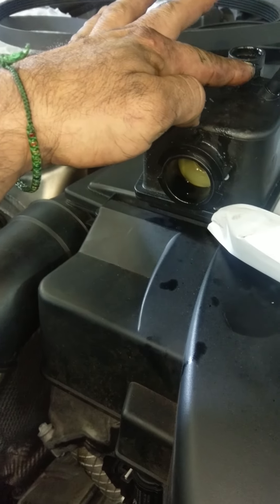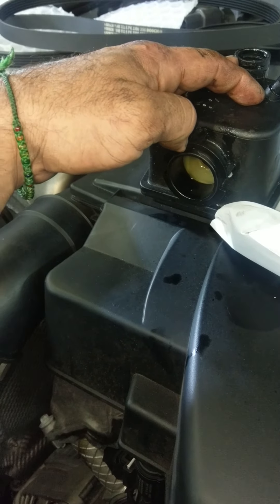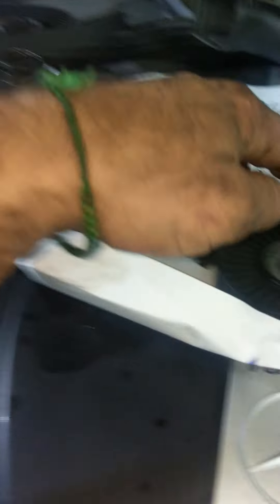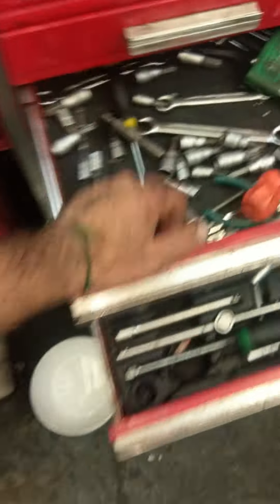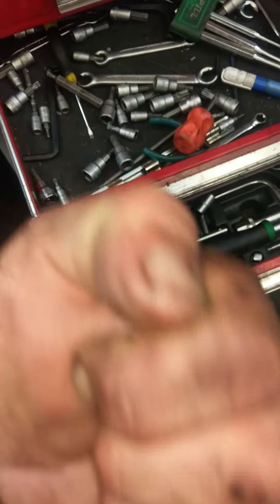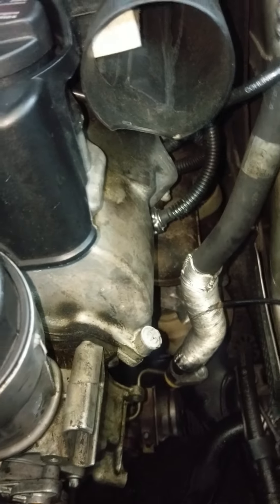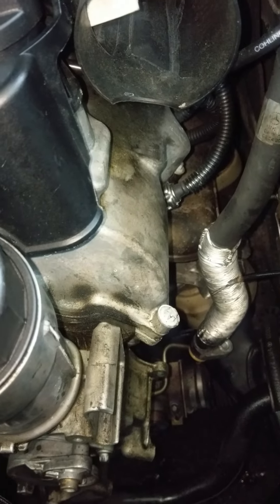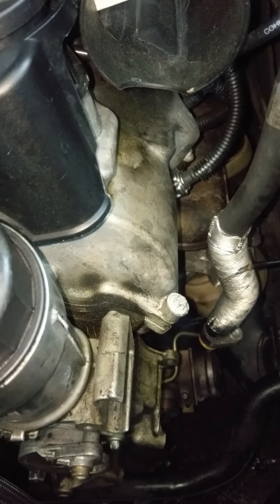The best way for this circlip is to put a fine screwdriver, leave it against the aluminium housing behind it, and then once you have clearance, just pull it out with one hand — get the screwdriver and go like that and pull the clip out. You don't want that clip flying away. This is not about keeping hygienic, cleaning, vacuuming, gassing, o-rings — it's about not ruining the job.